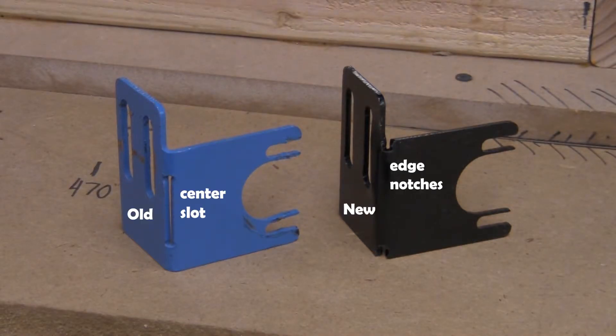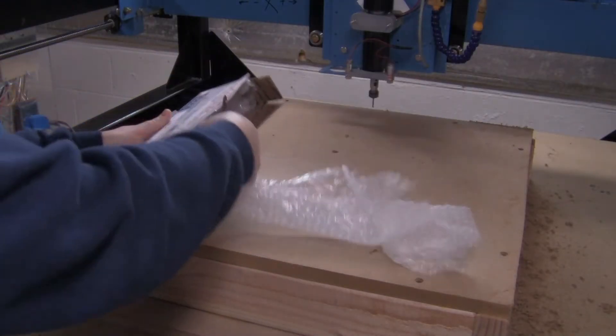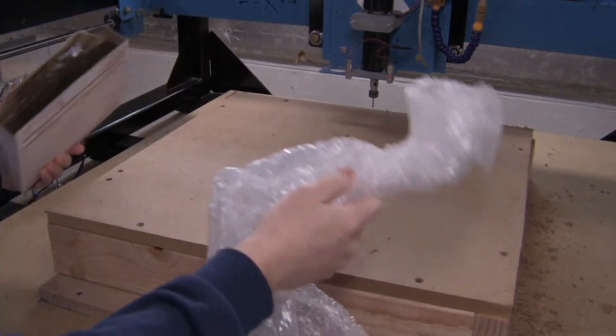Pushing on the machine I could see that two or three of the brackets had a lot of flex to them. A lot of the rigidity was lost just because of the silly way that I cut the bend marks on these brackets. So my dad was nice enough to cut me a new set of brackets that didn't have the same flaw, and I swapped those out, and that drastically improved the rigidity of the machine during movement.